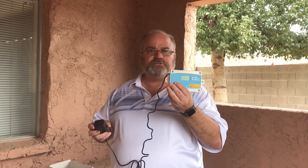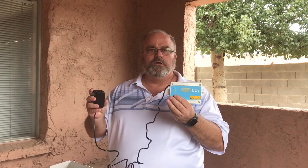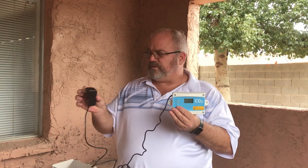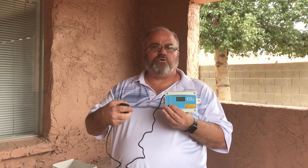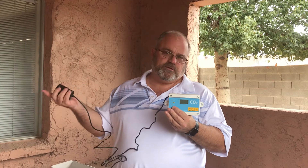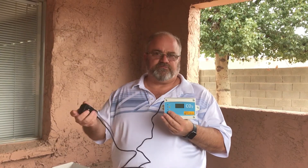Normally your CO2 detector can plug into a wall. What happens is if the power is lost, or if somebody disconnects it and reconnects it, this detector will go into a self-test mode. Part of the test mode is to actually activate an alarm, and it brings out the fire department and you have to evacuate the building.